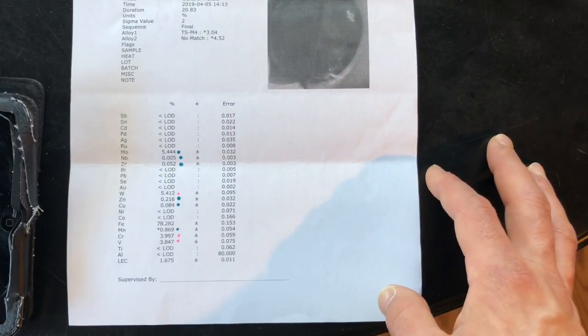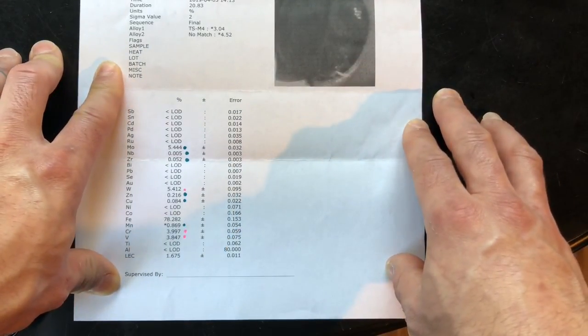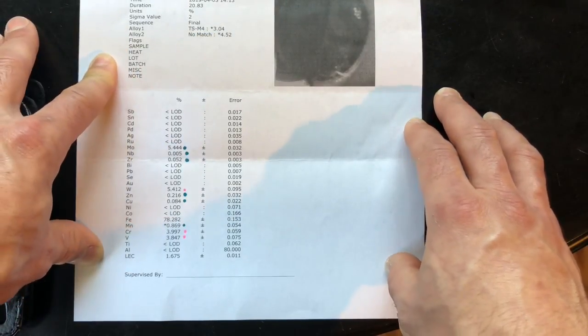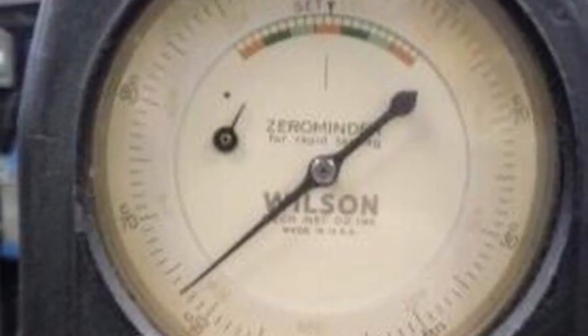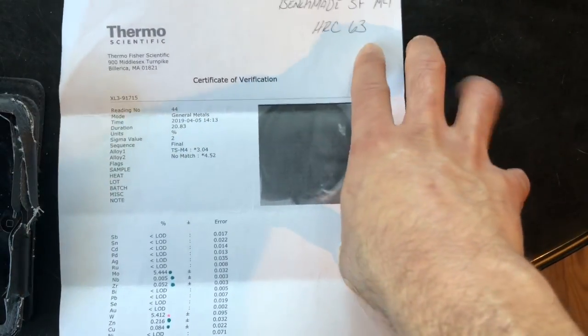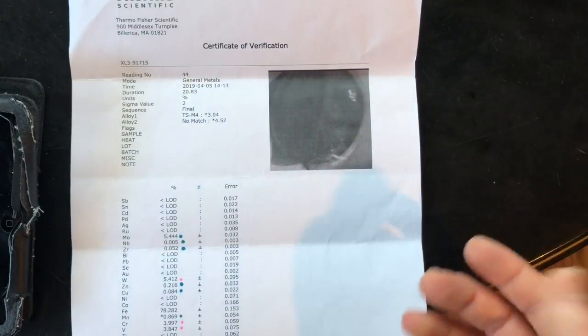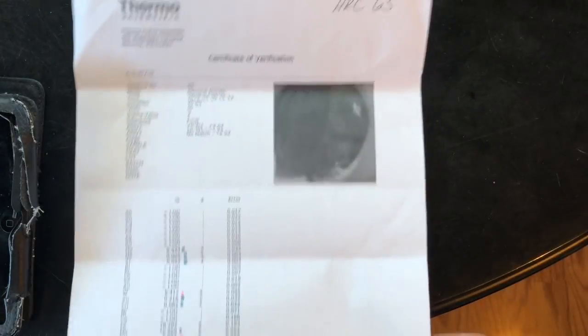You could see with calipers that it actually took off a significant amount of thickness from the blade — so it was a fairly thick coating — and it still had no effect on the HRC testing numbers. That's also a testament to the machine Kurt's using being so well calibrated, not even within 0.5 of what the reading was before. So the Benchmade Super Freak M4 is definitely on target, it's definitely M4, and the HRC reading on the Wilson tester came up at 63. Boys — holy crap! Benchmade advertises 62 to 64 on their M4, so they nailed it right in the middle at 63, and that's with the coating on.